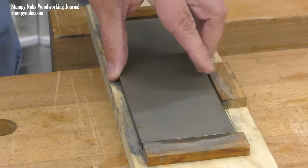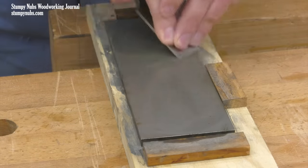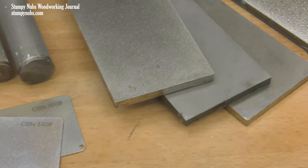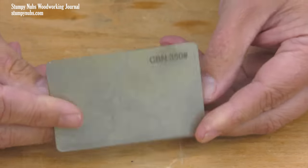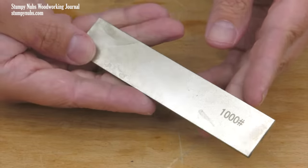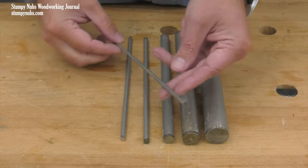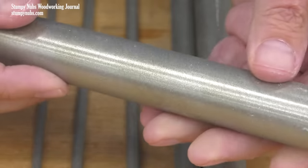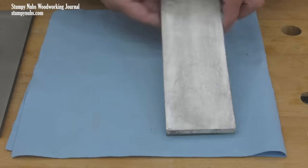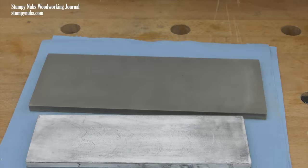But what about a bench stone like this one? Honestly, they seem to cut just as fast and wear just as well as diamonds in my experience, but the cost is significantly lower, as much as 50%. They also come in a wide variety of shapes and sizes. The credit card size is great for things like router bits and forstner bits. The pocket hones are especially popular among hunters and fishermen for knives and tools. One of my favorites is the slipstone that has radiused edges for gouges and other curved tools. The dowels are really useful for turning and carving gouges as well and for knife sharpening. And if you do still prefer waterstones for sharpening, and I personally use sometimes Shapton's really fine stones instead of stropping, well this huge 4x10 flattening plate is ideal for maintaining those.